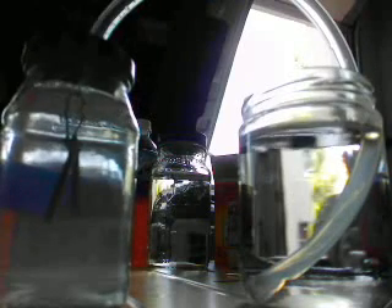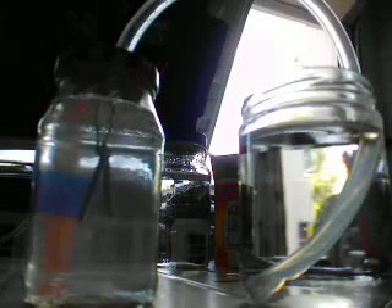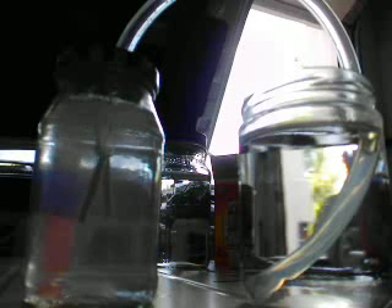I want to make sure the two electrodes are not touching because it'll start sparking and we'll have some problems. Now I'm going to hook it back up and you'll see what the electrolyte does. There you go — now you can see a larger amount of hydrogen just pouring off. If you look over here on the side, you can see how it's actually flowing down. You'll get nowhere near that amount without an electrolyte.